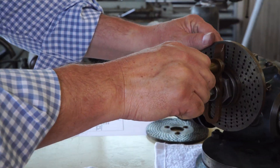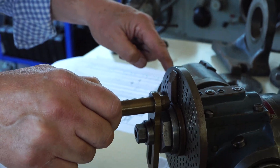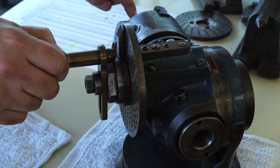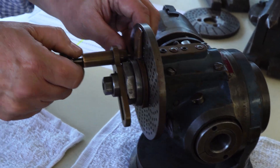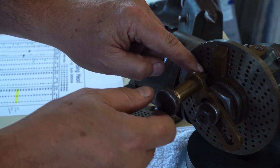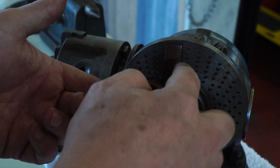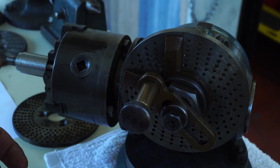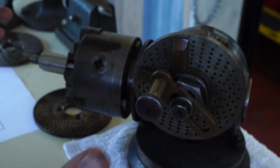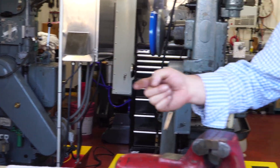The chart says two full rotations. So here's one — you can see this is moving — and then two, back to the beginning. And then 18 holes. So I rotate it all the way around, and that's the 18th hole right there. Normally these would be close together so you could spin them both, but there's no room to completely collapse them. So that's 1/14th of a turn right there.